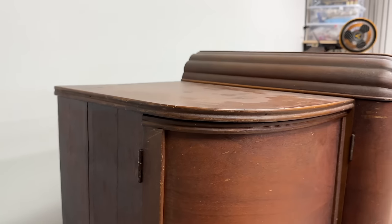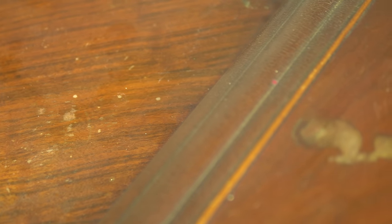This is the issue with solid wood where I live. It's just not the most stable product. It moves with the weather. You can see a lot of the alligatoring here on the finish. That sometimes also has to do with heat and humidity and damage from sunlight.